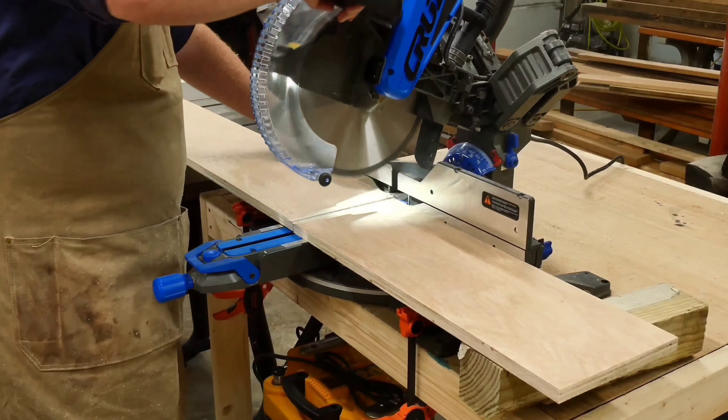After those were all cut, I set up the dado stack in the table saw and began to cut all of my dado slots in the sides of the boards. The two outer side boards will have a slot near the bottom and near the middle, while the middle vertical support board will have slots cut into either side of it near the middle. And finally, the fixed bottom shelf will have a slot cut into the top face of it. I'll show you how they all fit together here in a moment.